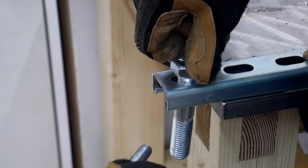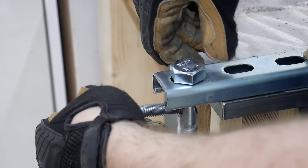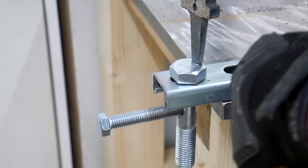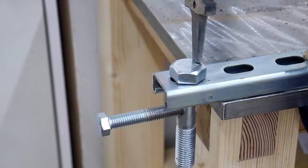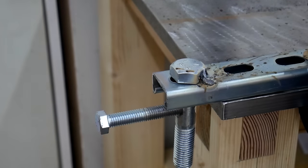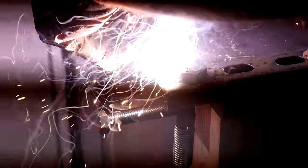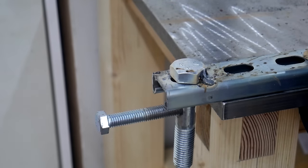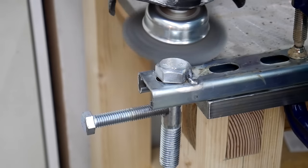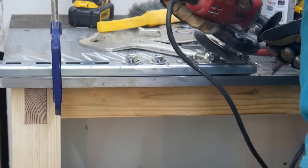I need to come up with a good name for this bolt — I can't call it a cross-threaded bolt because that would mean there's some damage to the threads. Anyhow, now's the time that I attach the bolt to the same apparatus where I attached the nuts and the washers. This bolt is also going to be tack welded in just like the nuts and washers. I orient it to make sure that the cross bolt going through it is parallel to the Unistrut — it will become quite apparent soon why I need that to be parallel. Time to clean up these welds and make everything look nice because one clamp is now completely finished, and now I'm going to demonstrate exactly how these clamps work.